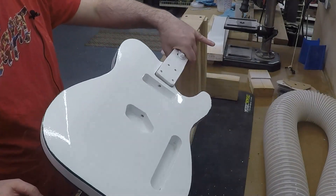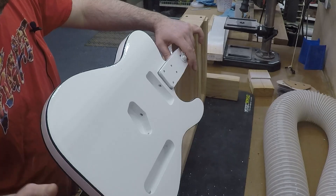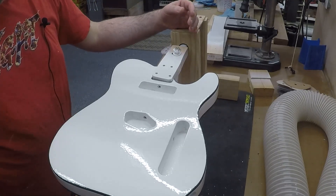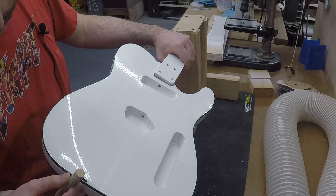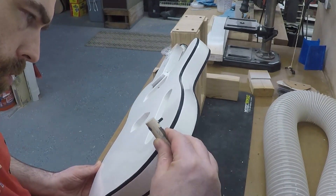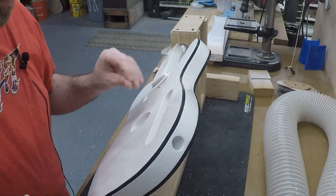The edge doesn't have to be perfect because I'll be coming back through and scraping the narrower part in a couple hours. This just came out of the booth — the stuff has only been on there for about an hour and a half, which is exactly where I want it. Because it is set enough that just brushing against the surface will not damage it, but it's also still soft enough that if I were to dig in with my fingernail, I could dig it up — which means it is at the perfect set to scrape the binding. I know I've made it a point to not work while I'm tired, however, because of when I sprayed the paint and needing to get the clear on within a certain amount of time, and then the time I've had to wait before pulling the binding off, it ended up being quite late — but I am pushing on.